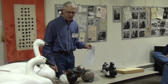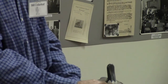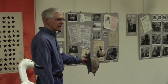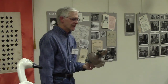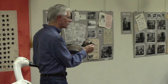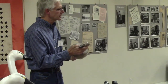The one exception I had is I did a poor job of aligning the grain properly to go straight down the bills. I had my dozen decoy sack filled with decoys, all with their bills up, set on top of a pile of sacks of plastic decoys in a shed with a concrete floor, came back in the morning and had done a 180. And I had like five bills to repair. The ones that needed repair were ones where the grain went this way or that way. But if the grain was straight down the bill, they didn't break. So now I'm real careful to make sure when I lay out that head block that the grain goes straight down the bill.